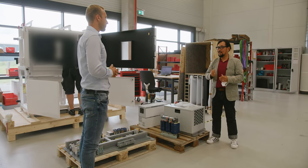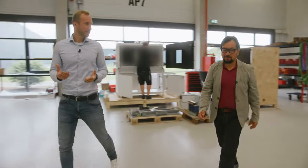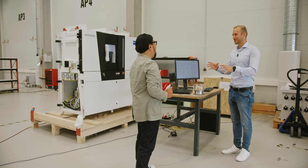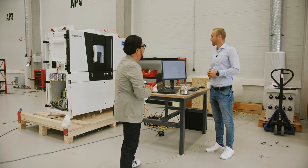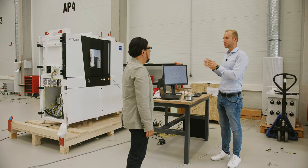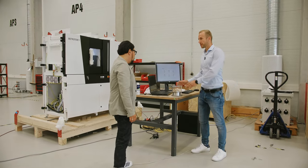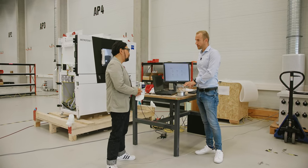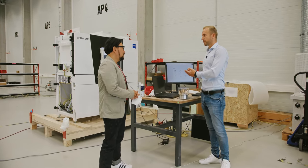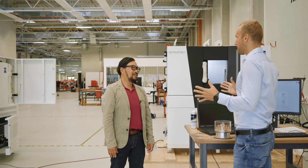Can we see what happens after that? After that we will have a third stage — the final step. This one looks almost ready, close to be shipped to its final location. This is one of the most important steps: this is where we check the system and do the final acceptance test by using this artifact. This is a CMM calibrated artifact — we know the distance of each of those spheres and we can check the system accuracy. You test before any of these go out the door, to a known reference artifact. We want to have the machine in perfect shape at the customer's side.